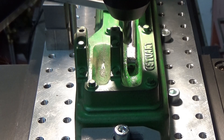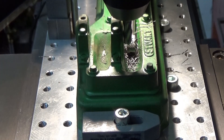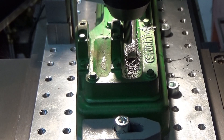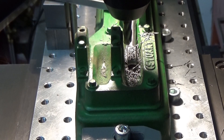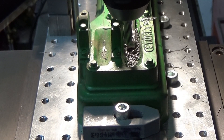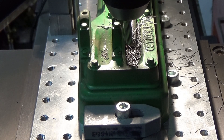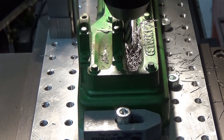I just touched down on it and I'm going to set my DRO at zero. It's going to take about a 10-thousandths cut each time. This is the final cut — this gives me 50 thousandths.